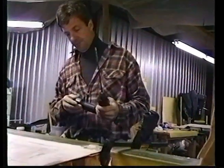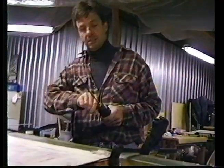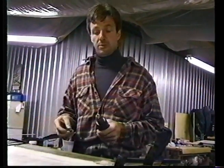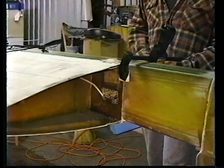I'm going to take this one out to 1/4 inch first and then to the 5/8 counterbore. Every one of these is identical, so we're not going to beleaguer the issue and force you to watch all of them. This cuts pretty aggressively.